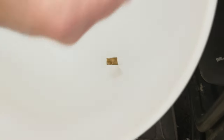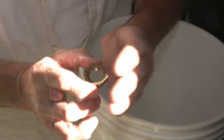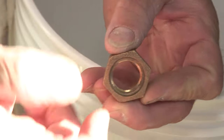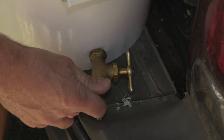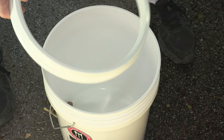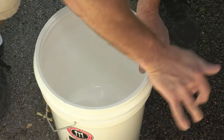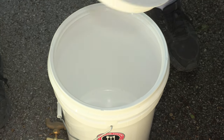On the inside I get the O-ring on just like that, then get the brass nut. These brass nuts have a little recess, and I found that when you use the nut with that recessed side toward the O-ring, it presses the O-ring into the threads of the valve and seals the whole thing up. The valve is in there, it's all tight. The O-ring is pressed against the valve threads and the bucket. Now it's time to put the lid on — I get the ring, snap it in there really tight, and that's it. Super tight; in my experience those fit really well.